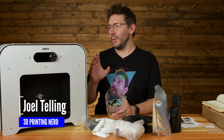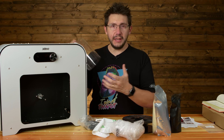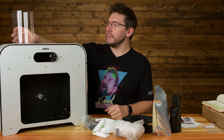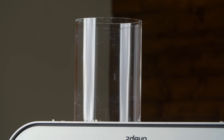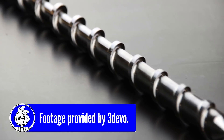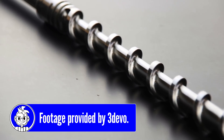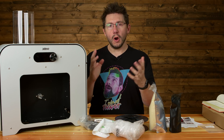Welcome back. We're going to get this set up, but first let's talk a little bit about this machine because it's a little more everything than the previous machine — it's bigger, it's badder. Just like the other machine, there is a hopper up top, and this helps funnel resin, PLA resin, ABS resin, different pellets, ground-up prints, stuff like that. The machine then takes that and gets it down into the giant screw that powers all of this material forward. There are four different heat chambers that the screw takes the material through, and that's important because the heat profile for PLA material is way different than the heat profile for PEEK or PEI or carbon fiber nylon.